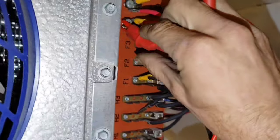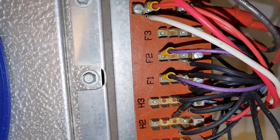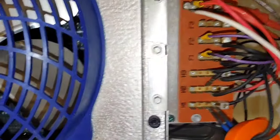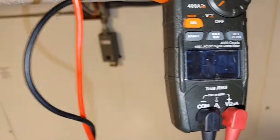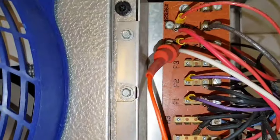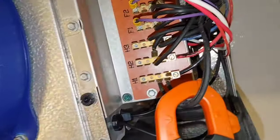I don't have 230 volts between four and neutral. Between three and neutral I've got something weird, but between three and ground I've got 118 volts - half of my 240 - and that's the only place I have that much voltage. Between four and ground I've got something weird, around 19 volts backfeeding. So we've got something electrical going on. We could have something keeping the compressor from coming on, like a low pressure cutout.